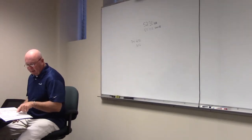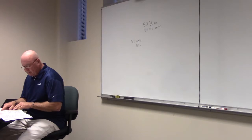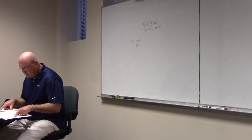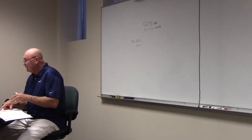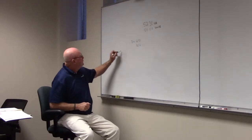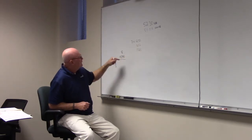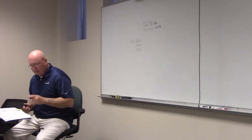Everybody good? Okay. Now the next thing, it says a 3/4 horsepower disposal. So let's stay right there where we're at on our 430.248. 3/4. I mean, I'm sorry. Yeah, we done that one. My bad. 1 horsepower, 240 volt pump. How much is it going to be? 8.0. Why don't we use the 230? Because it says we could, right? There's not a 240, so we take the one closest to it, right? So it's 8 amps, okay, times what? 240, which is what, about 1932? 1920. Oh, I'm sorry. Yeah, 1920. I got 32 because 8 times 4 is 32. That's where I'm getting that from. Okay. All right. 1920.